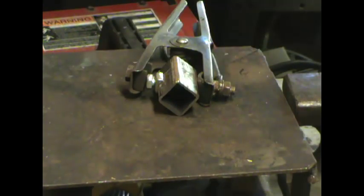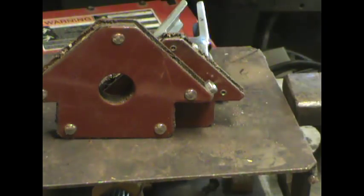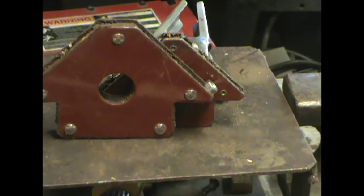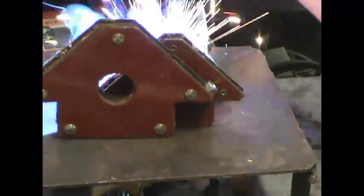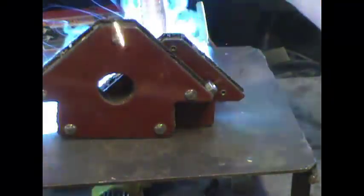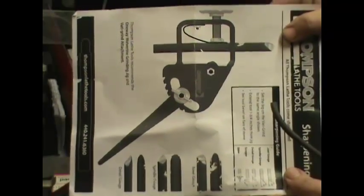Here's my piece of metal that I'm going to weld — my square. And here is the nut. It's got the bolt through it to help keep it aligned, and I have it clamped with my ground clamp. I don't want the flare from the MIG welder to go into the camera, so I'll put a big magnet here to kind of block that a little bit. I've got my welding helmet on. I'm welding with argon CO2 gas.